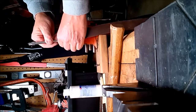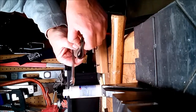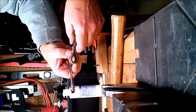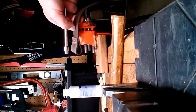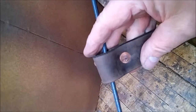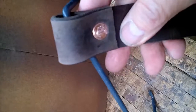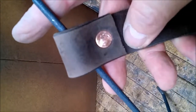I'm going to try the broad end here once. We've got that washer set and now I will simply smash the end of the rivet down so it mushrooms over the top. Yabba dabba doo, I've Fred Flintstone my way through another creation. Here's your copper rivet and on the back side the mushroomed — albeit not pretty, but does the trick. I used a nail set upside down, so the rounded off head part, to kind of taper the mushroomed end of the rivet over the washer.